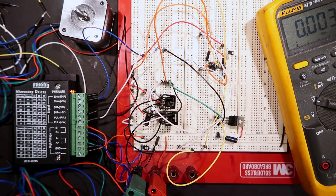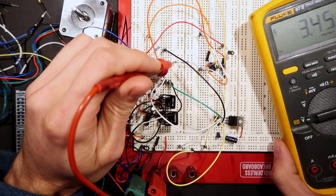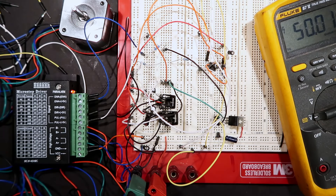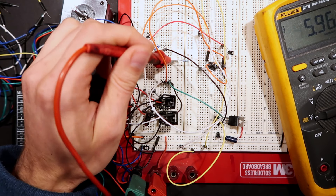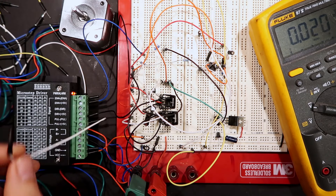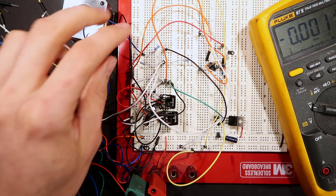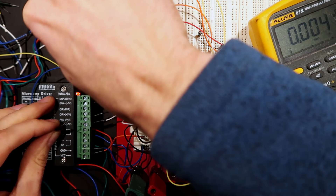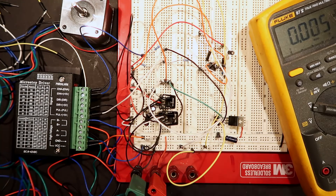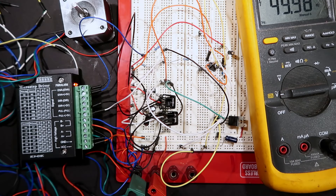Let's see what frequency we have on our 555. We have three hertz, so it should be working but very slowly. We set up a little voltage divider — looks good enough. So there's our enable, pulse at five volts — it should turn now. It's switching but not turning. Possibly one of the coils is hooked up backwards. After swapping, it's actually turning. How about 10 hertz? It's doing stuff but not making very happy noises.